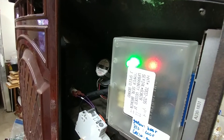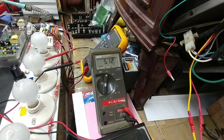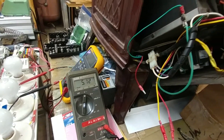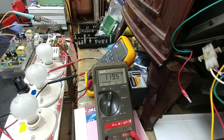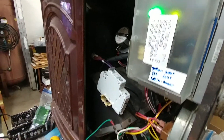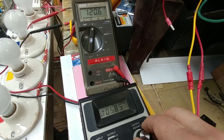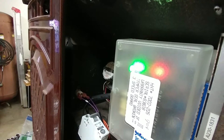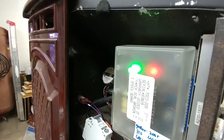If I simulate not calling for heat, the fire drops a little bit because I'm not driving pellets into it. I've lost my red light, so I'm at 500 degrees Fahrenheit — I'm back in yellow. If I turn on the call for heat, the element should come back on. There it is — we see 120 volts AC being called, the auger is being called on to draw pellets into the fire, and my temperature should slowly increase as the fire temperature raises. As I get to 600 degrees, my light will go from yellow to red — and there it is — and the element gets shut off, and everything is in normal mode.